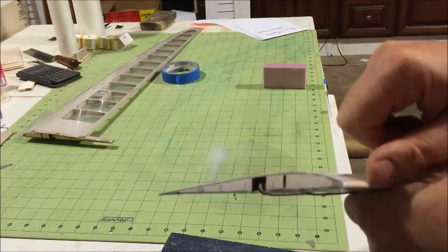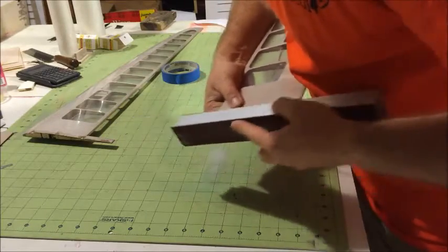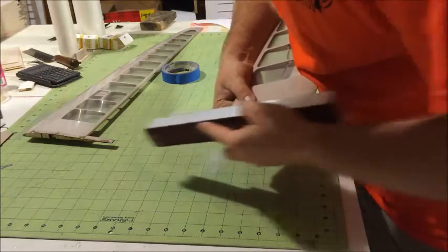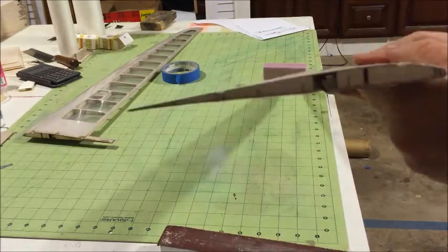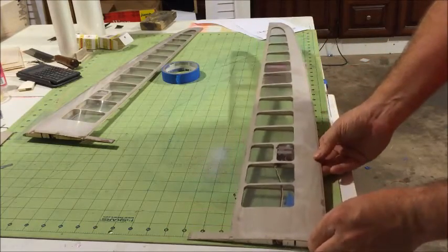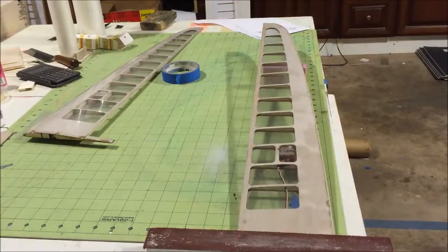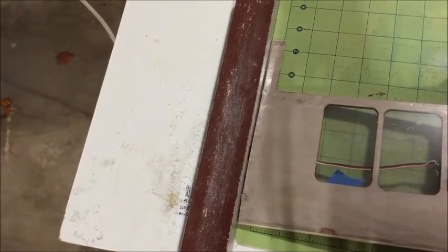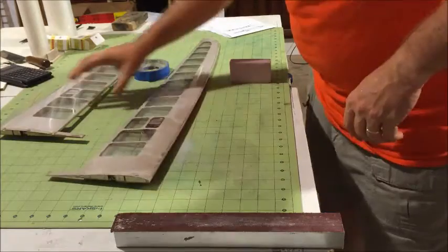I have to cut a little bit more from the front. You pretty much want to use very rough paper. All the markers have disappeared — check the angle. I measured 19 inches, 2 inches high. I'm pulling the block here and I don't see any space between the block. I have a nice angle sanded there. And I'm going to do the same thing on the other wing — just the opposite mirror image.